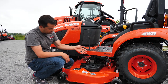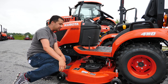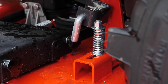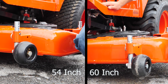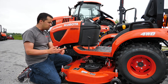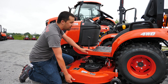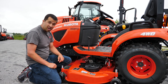The 54, like most tractors, is pinned directly onto the mower deck, but the 60 actually isn't, and a lot of guys miss this little detail. There's actually a rod that runs across the back of this mower deck with a spring on top, and when you lift this deck up and down you'll see it actually has more left-right travel than the smaller 54-inch does, because of the way it pins underneath the tractor. If you have really uneven ground you might think the 54 contours a little better, but because the 60 has more travel and isn't as rigidly tied to the tractor, it may actually contour better than the smaller deck does.